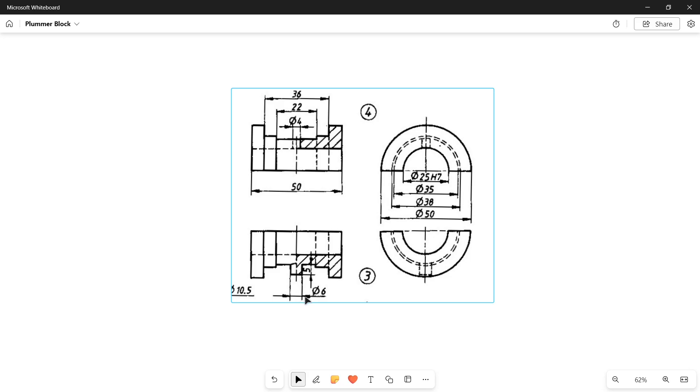Once done, I'll mirror it. If you draw a circle of 6mm and extrude it, it becomes the bearing bottom half. If you draw one circle of 4mm and cut it out, it becomes the bearing top half. Let's start with the 50mm and 25mm semicircles.